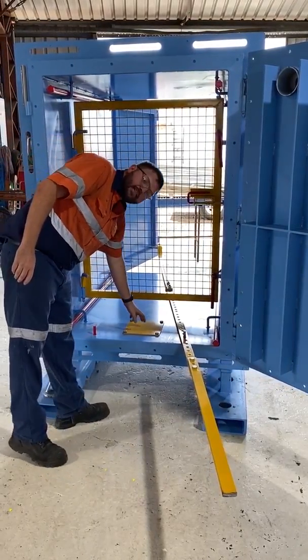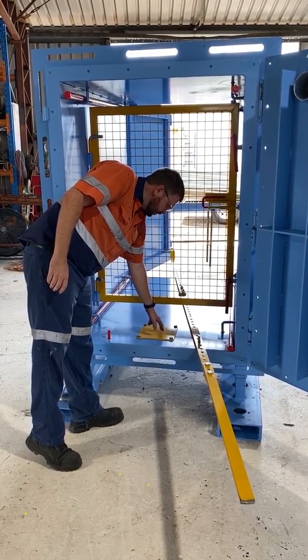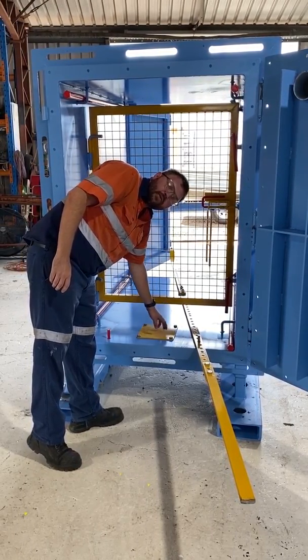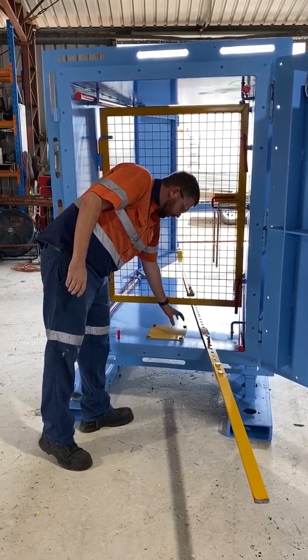We've also allowed an access hatch under here in case we have issues pumping the concrete underneath the seal. Remove these 4 bolts, which have welded nuts underneath them, check it's full of concrete or pump it full of concrete, and re-affix the top cover.